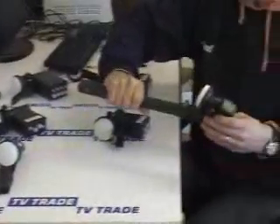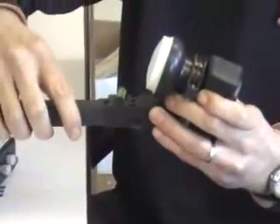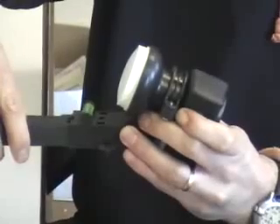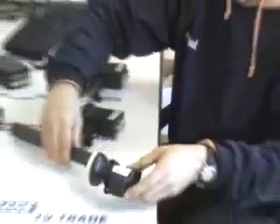These LNBs took a little while for people in the industry to get used to, but in a lot of ways, particularly with the spirit level here, for the DIYers it makes it very easy to set up this LNB, because you have a gauge. Obviously the idea is to have the bubble exactly in between the two marks, like a traditional spirit level, how it operates.